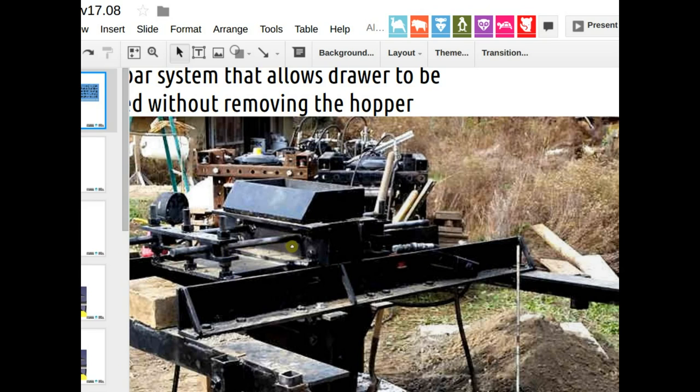What we did here was put the guide rods, 1-inch shafts, through the top of the frame, as opposed to before when we had them attached to the arms. There's a real workflow detail, a build detail, with respect to extreme manufacturing, meaning the quick one-day build, that matters a lot in this redesign. If you had the guides attached to the arms, you would have to get the arms in first before you started working on drawer alignment. What that meant for typical builds was that we couldn't actually run or test any of the alignment, which is the main thing.